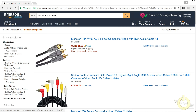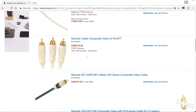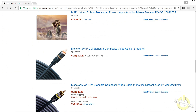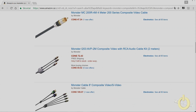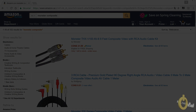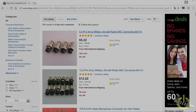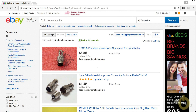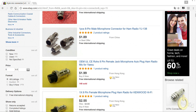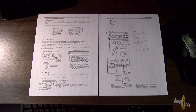I bought these Monster cables at liquidation for about $3 each, that's why I have a lot. Then you need the connector for your microphone — in my case it's an 8-pin round connector. These are a lot cheaper on eBay, but I had one in stock. Now depending on your radio, you need to find the correct pinout. You can find it on the internet — print the manual page and write the diagram so you have the correct connections.